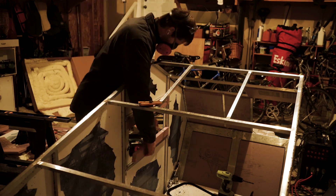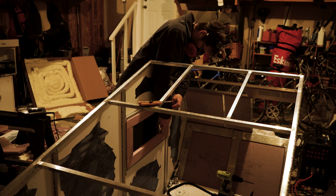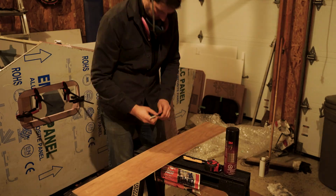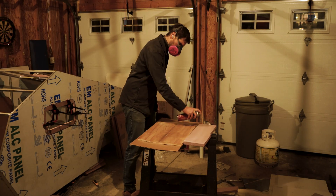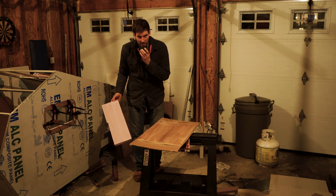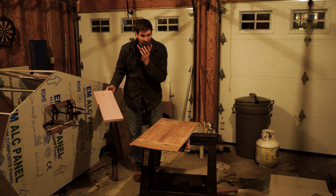Now I'm gonna cut out these little pieces of insulation, stick them in there, and that's gonna form the frame. The interior trim ring screws from the inside into the window, squeezes together, and that's how you install it. I'm using 3M77 here to do a test for my floor material. It's supposed to let it wait at least 30 seconds after spraying until it gets a little tacky, but apparently you have up to 30 minutes to actually join the surfaces.